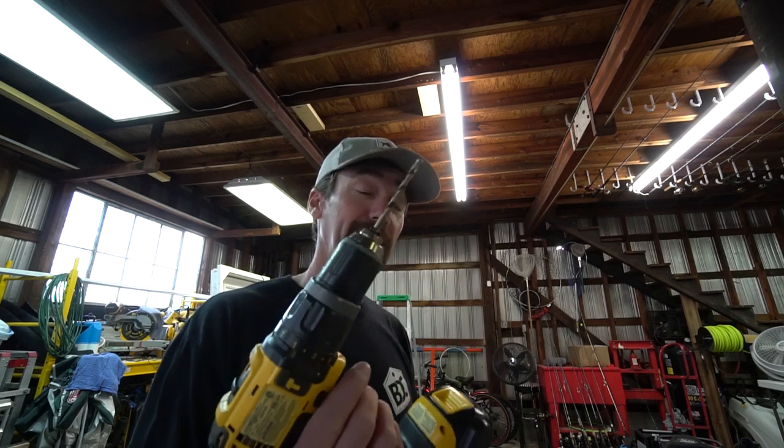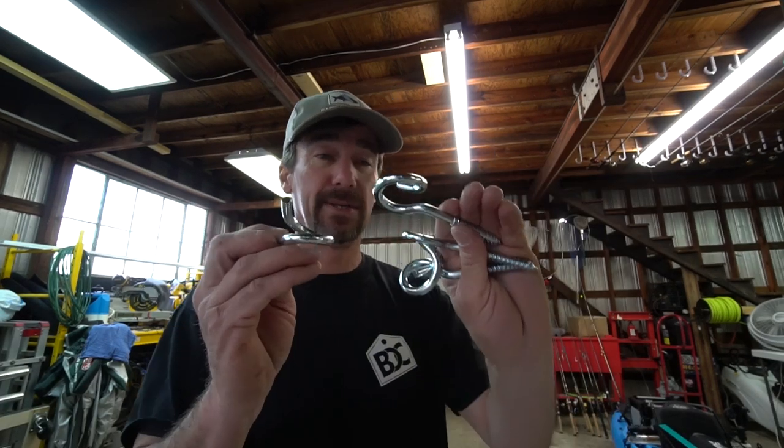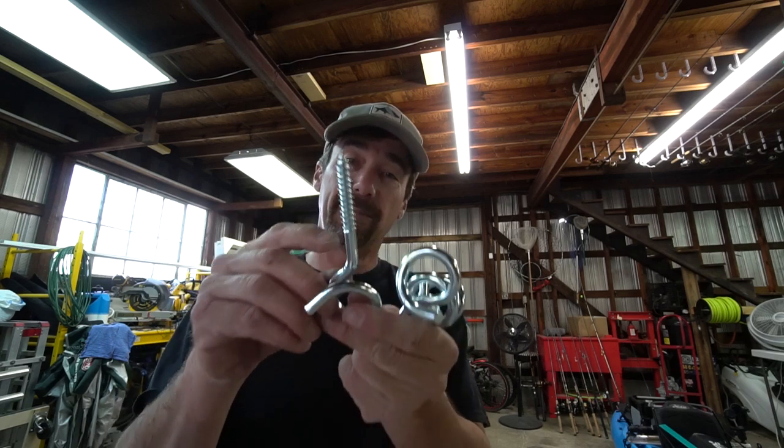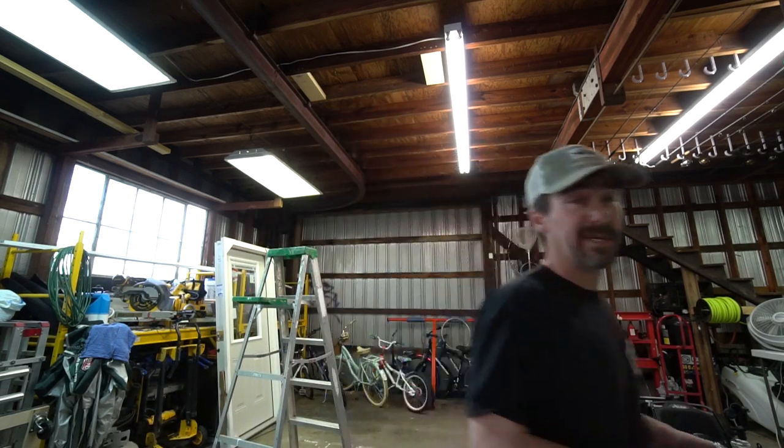You don't have to worry too much about runner boards with an open ceiling — that's more for a finished garage with sheetrock, where you'd definitely want to follow the directions to get mounting points into solid wood. I've already planned mine, know the mounting locations, and have the blocking already up. I have a 7/32nds drill bit here and I'll drill the four mounting locations, then get the anchors in.